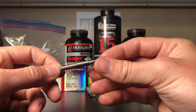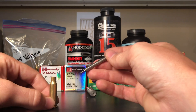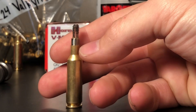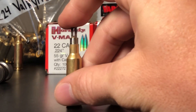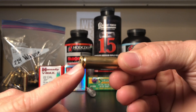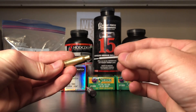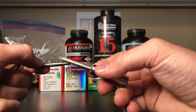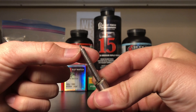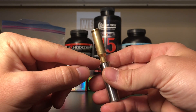However, I did run into an issue. The .222 Remington pin has a nice tapered shoulder that runs into the pin coming out of the firing pin hole. Using my .223 Remington case gauge to demonstrate - if you slip the .223 down in here, the shoulder protrudes out of the neck in excess. Basically my cutter is up here and my brass would never come in contact to be trimmed. The angled portion on this pin runs into the bottom of the brass, so it can only come out so far.